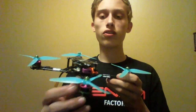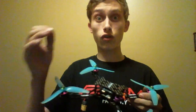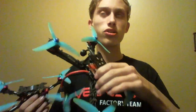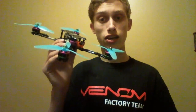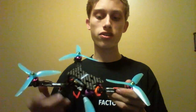This quad feels very snappy on this motor and that's where it really shines. If your builds are below 240 grams and you're trying to build something ultralight, I think this motor is going to be perfect — definitely an A-plus for thrust. If I put these motors on a heavier quad it probably won't fly as well because it just won't have the thrust to drive that frame. If you're buying this motor, understand that you should be putting it on an ultralight setup — anything below 250–260 grams max. This build is 225 grams, so it's pretty light.